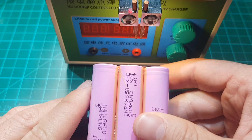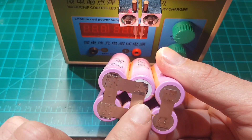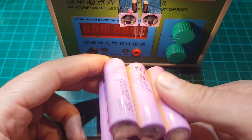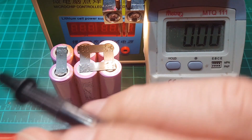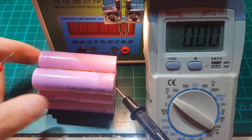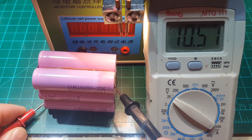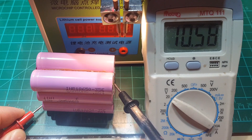This is pretty much the final form of the battery. Make sure that what you see here is what you have built, and if so, continue with adding the battery terminals. But first, let's measure the voltage so we are certain that every connection is correct. Here we have 10.5V, which is pretty close to the 3S nominal rating.